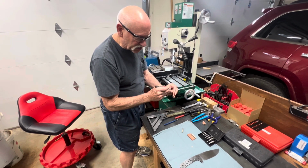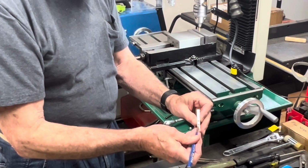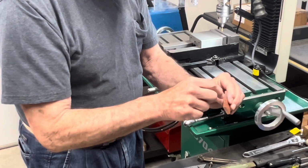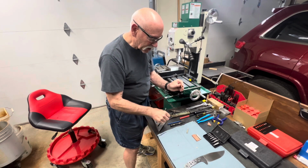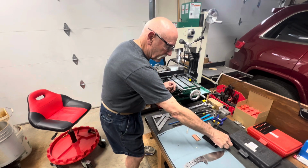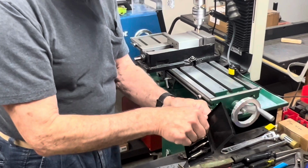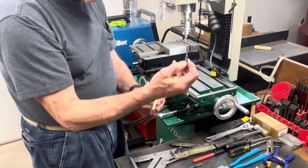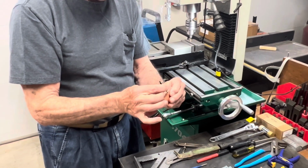I first used a hand punch to punch along a center line, and then I used a heavier punch to make the center punch deeper. And when I did that, I didn't realize, or I didn't see right off, that the punch hole was not centered on the line. What I should have used from the beginning, instead of using these 2 punches and then running it through the drill press, is one of these centering punches. These centering punches are useful because in order to get the holes lined up exactly on the center line, I could have put one of these into the mill and then centered it right on the line in the middle, the scribed line. That would have been perfect, as perfect as I could get.